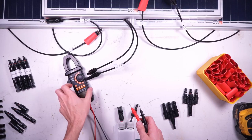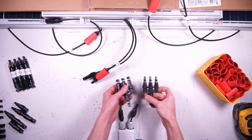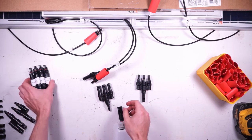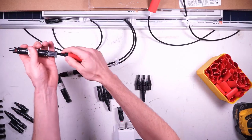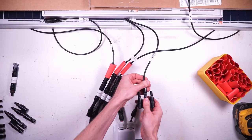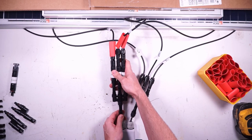What if we have three solar panels? Same story to start — double check which wires are positive and which are negative, then cover up the panels. This time we want to use three-to-one MC4 branch connectors. Depending on the size of the panels, there's a pretty good chance we're actually going to need to introduce fuses into the system. To do that, I have these MC4 fuses. I'm going to attach a fuse to each of the positive solar panel wires and attach the fuse to the branch connector. All the negative wires get connected to the negative three-to-one MC4 connector. Then these two three-to-one branch connectors get connected to the positive and negative wires going to the charge controller.